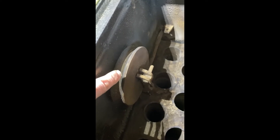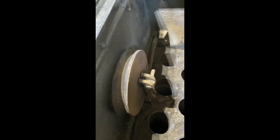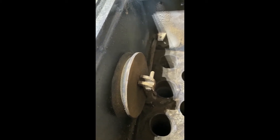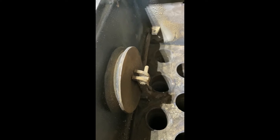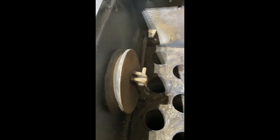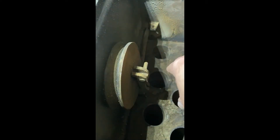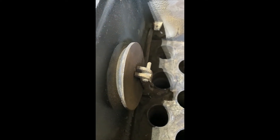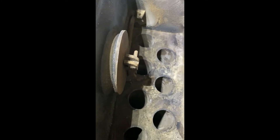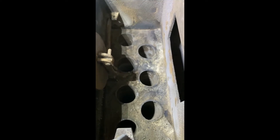This is the bypass mechanism. In the first year I burned the boiler, this thing always seemed to stick closed from creosote buildup in the primary burn chamber — it gasifies in the lower secondary chamber. What I found with my first boiler is that after the first year it doesn't stick anymore. But if it does stick, you can open the bypass and scrape it occasionally, maybe apply some high-temperature anti-seize — that helps for a while, and eventually the problem just seems to fix itself.